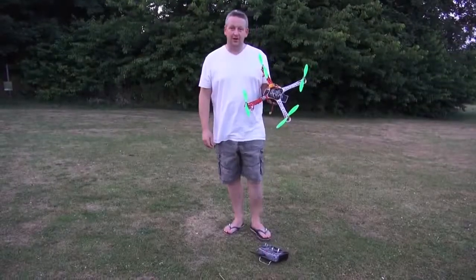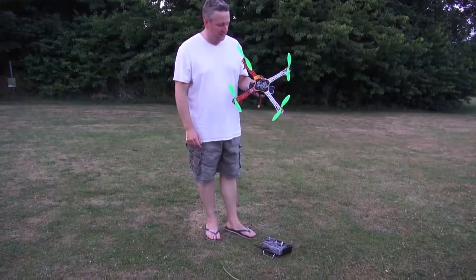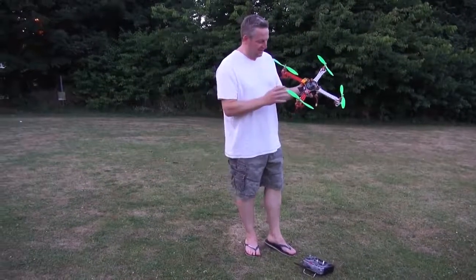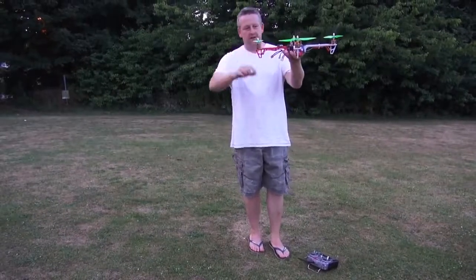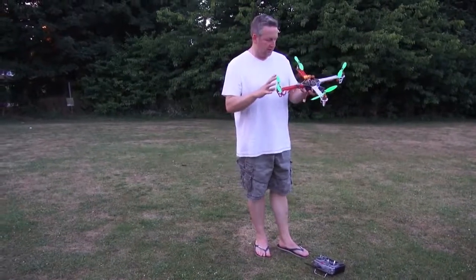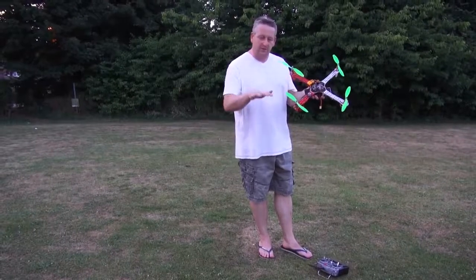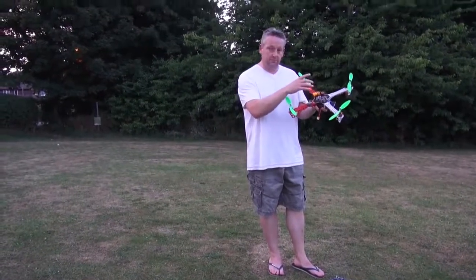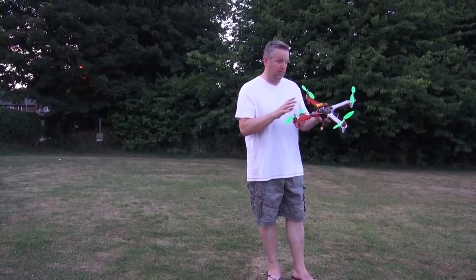You've just seen the night flight, filmed on Malk's phone. We were a bit eager — it was about half past two in the morning, so that was day two. I've had a little bit of time between dealing with the family to change a few things. The props were really, really high before, so I've just gone in there, cut the props down, and got the hubs nice and low. I've also had a little bit of time to have a look at the KK board and adjust a couple of the gains. I had a bit of a hunting issue last night — it seems to have been solved by either the gains or what I've done to the shafts. Only a few improvements but she's flying better already.